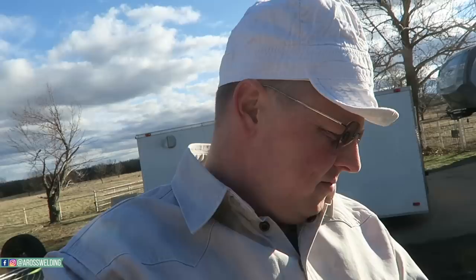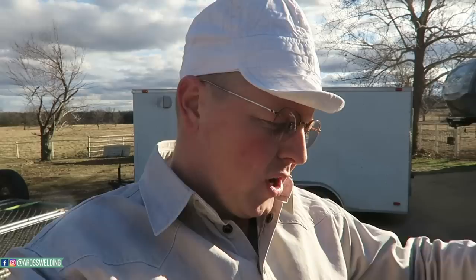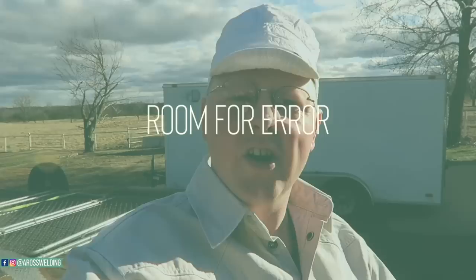A lot of times guys with a lot of experience, or that have been doing it for a long time, may not worry about something like this. If it's an inspector they've tested for before, or they're just real slick with techniques they've learned over the years, they won't worry about it. But when you're just starting out and young, trying to prove yourself, and you just drove 20 hours to another state to take a test and your job depends on it, I really encourage prep. It's all in the prep, especially on bigger pipe. This kind of stuff is more important because there's more air in pipe that's bigger than 12 inch. So it's just a good habit to make sure it fits super good.